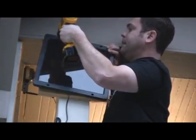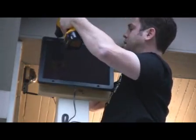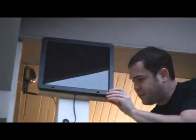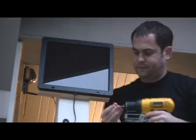Make sure your solar panel has an unobstructed south-facing view so that it gets maximum sunlight. If you have large shade trees on the south side of your home, this may require mounting the solar panel on the roof or constructing some kind of mounting bracket that brings the solar panel clear of obstructions. Solar panel manufacturers generally sell extension cabling if you need a longer cable run for unusual placement.